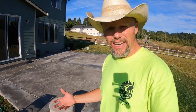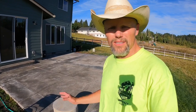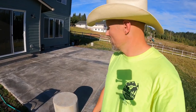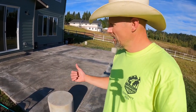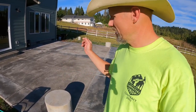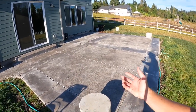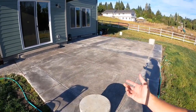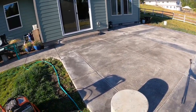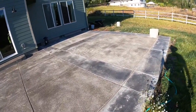The reason that I did that was I was going to cover it with plywood so they could keep doing the siding and other parts of the home building. I didn't want it to get damaged. And this was wet back in December, so the wintertime. What happened, which is notorious for exposed aggregate, which is what this is, is that the moisture was trapped in it, and when it started coming through, it discolored the sealer, which gave it this almost ashy white kind of look to it.